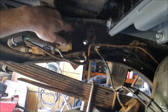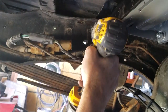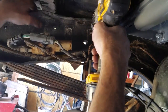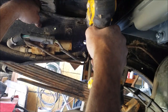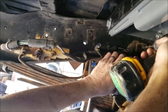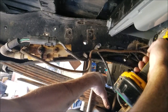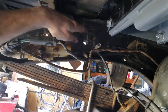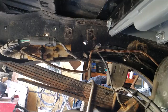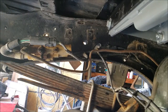You can see this is where the bracket goes that holds the shocks and a few other things. I've got the same size 3/8-inch bit — I'm basically going to line them up and just mark the hole. There's another one up by the fuel tank for the front one. These holes will have to be bored out to 9/16-inch to take the half-inch bolt, and I'll have to do the same to the brackets. We've basically fingerprinted where we want to drill our holes, and I'm going to do that on the drill press.